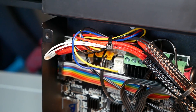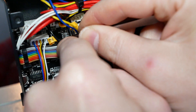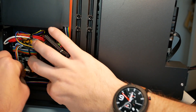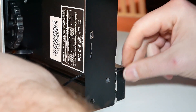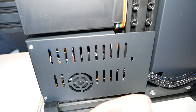Locate the BL Touch socket, which is white. Take note of the revision of the motherboard as you're going to need it later. Locate the z-stop, manage your cable, and unplug the z-stop cable as well because we're not going to need it. There's a trick — you can just remove the front screws and it will leave a gap big enough to route the cable and get rid of that z-stop cable.